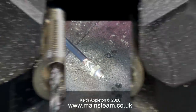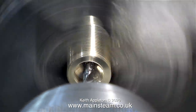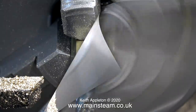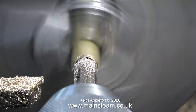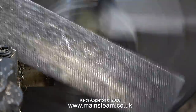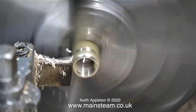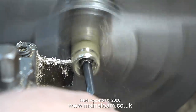Once the part had cooled sufficiently I quenched it in water, then went back into the main workshop to make the part for the other end of the hollow stay. Same principle as previously shown, except this one does not have a hexagon part in the middle. Instead I'm making a nut to go onto it after it's been fitted to the boiler. The thread is again 3/8 by 40 threads per inch. I'm removing the sharp edges with a file and now parting it off. When parting off small components, it's a good idea to stop them from falling into the chip tray — I normally use a drill shank as shown here.